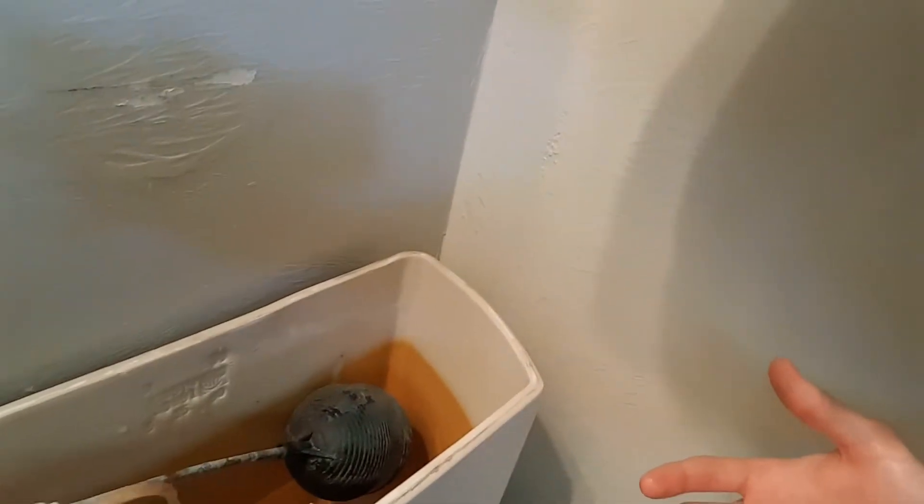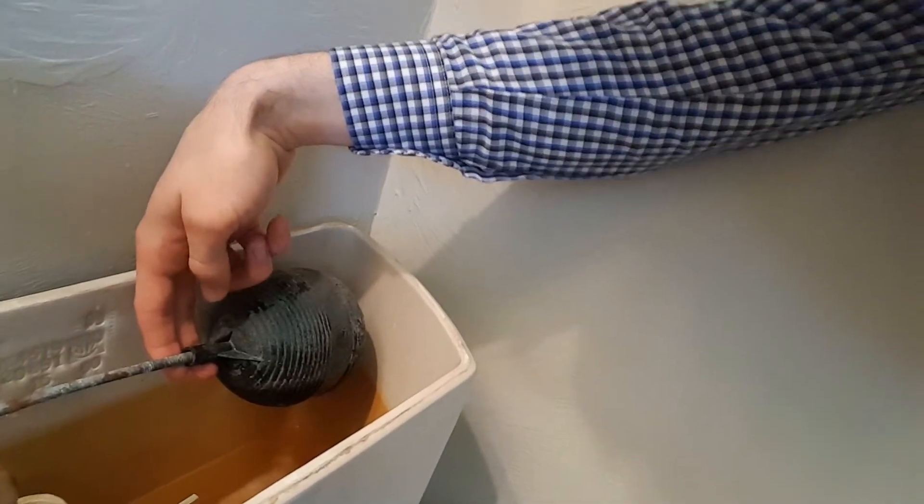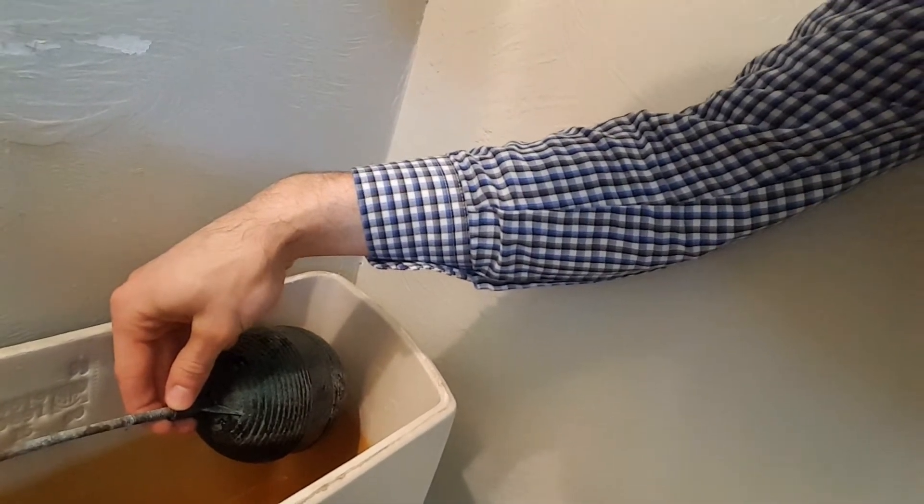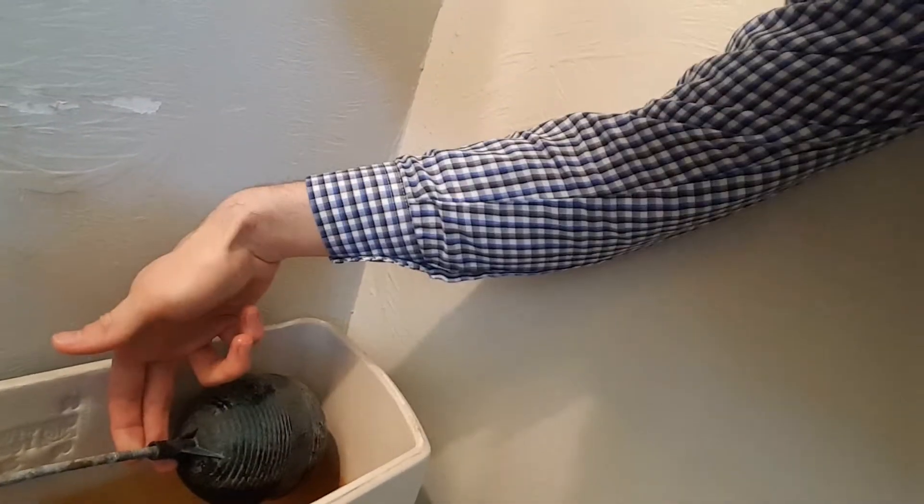You can do it two ways. Imagine the water is rising and you can tell it's filling up. All you need to do to stop the water is pull up on the floater right there. There's another way: you can come down here to the ball valve and turn that off. That's a last resort, but it'll keep the water from overflowing and you can plunge it to get rid of the issue without an overflowing problem.